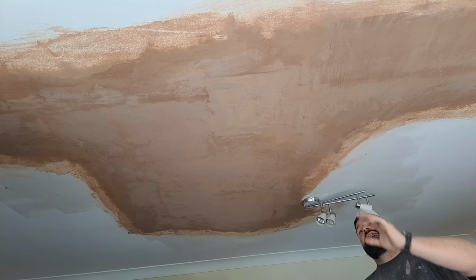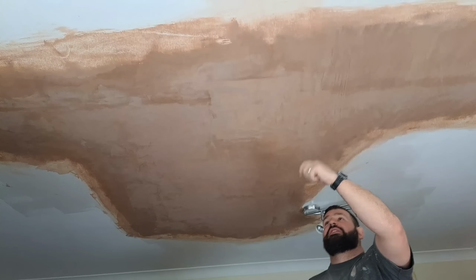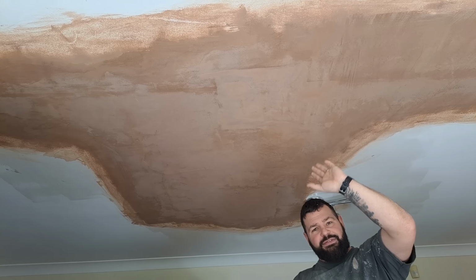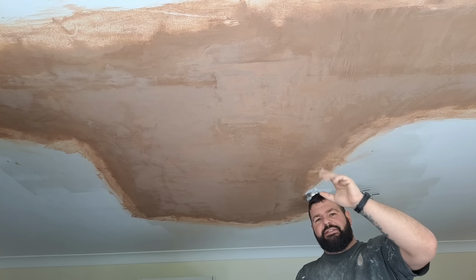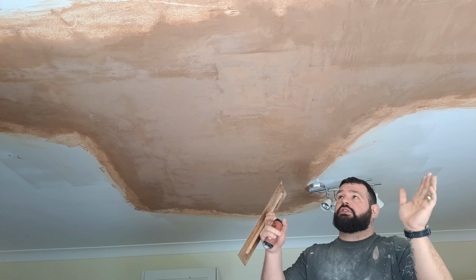And flat. The little thing we did, the ripples, that's worked. We brought the fat up with brushing it, and then we troweled it, got a good hard trowel, but after brushing it we let it stay for 5 minutes. If you do it straight away, you'll end up causing loads of bubbles in it. I don't know why that does that, but it just does.